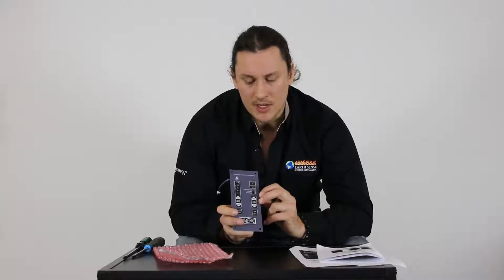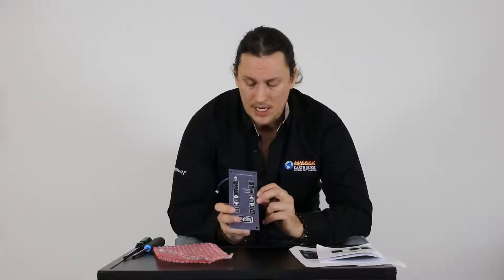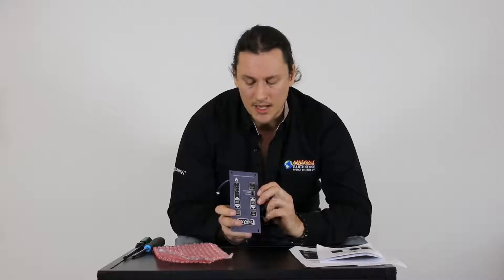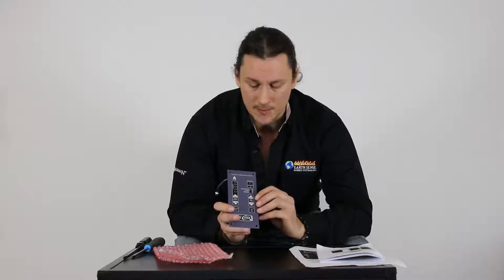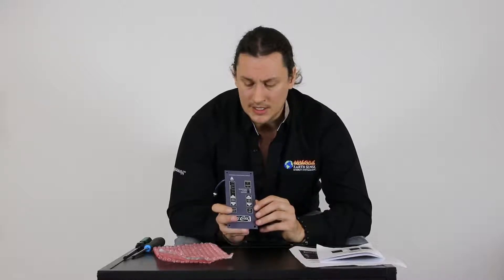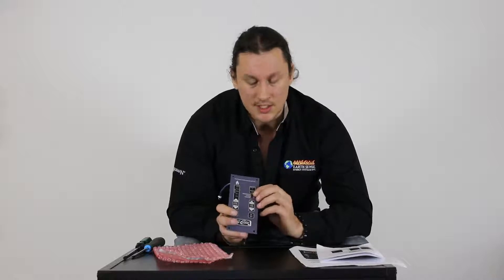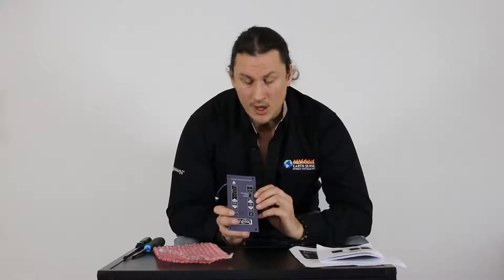Once you are in the proper program for your model and fuel type, you can simply leave it in that program — it will blink that series of lights on your heat control. You let that be, the control board will go blank, and you're ready to start up the stove now that it's in the proper cycle. If you run the unit on manual, simply press the on/off button and it'll start going through the startup cycle. If you operate your stove in thermostat mode, you can set that to either smart stat or T-stat mode.